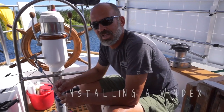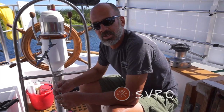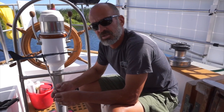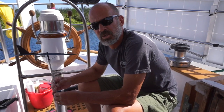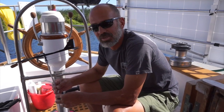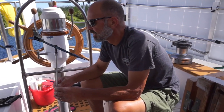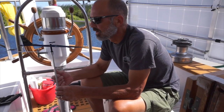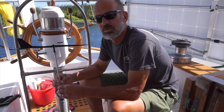Hey, welcome back to SB Ramble On. Last weekend we took the boat out and noticed that when we're sailing we can't really see the wind vane and which way the wind is coming from. We can see the gauges we have in the cockpit, but if anybody's on the starboard side grinding the winches, you can't really see the gauge and it's hard for the helmsman to steer the boat. It's easier if you can see where the wind's coming from. So I picked up one of these Davis Windex 15s directional wind indicators, and I'm going to put it on the aft side of the masthead — that'll give us a better indication of where the wind's coming from and how high we should point when we're sailing.